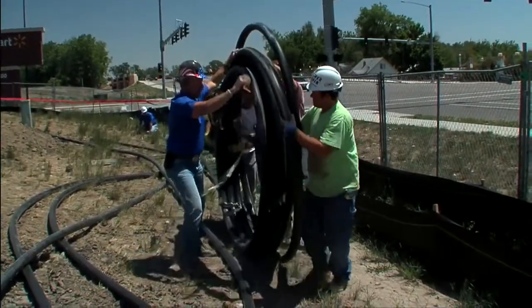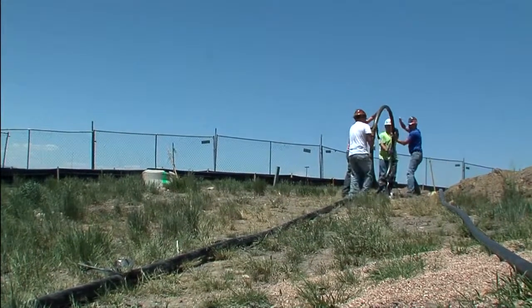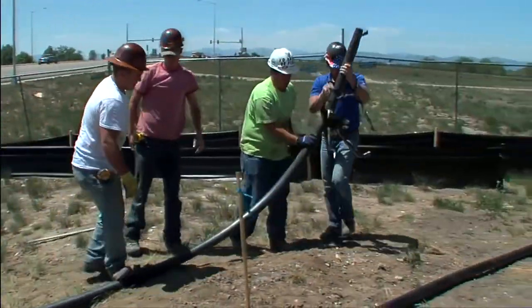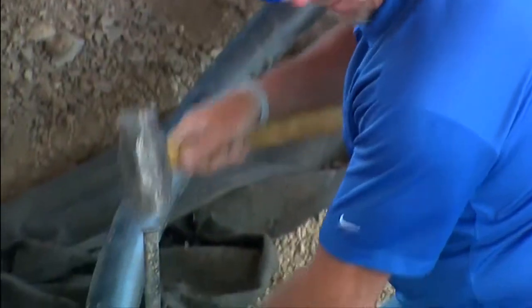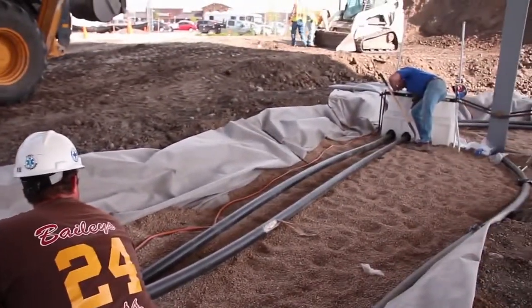You can get lengths up to 165-foot rolls. You've got the best of both worlds with UPP pipe. You've got a semi-rigid structure, but you've also got flexibility. You can actually take and sweep the pipe like a flexible pipe and build a radius into it, so you're not having to build joints out in the trenches, and you can actually go from sump to sump on a continual run.